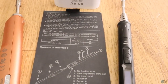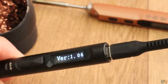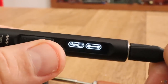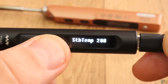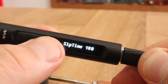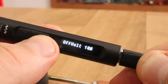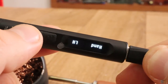Let's power it on. Plug the supply adapter that will give us around 9V, then plug the USB and it will automatically start — there is no on and off button. The USB cable is made out of heat-resistant silicone and it is very light. If I press the left button it will start heating, and the right button is for settings. In settings you can set the temperature limit, sleep time, and output power. Interestingly, the power can go over 18W — up to 24W. We also have voltage limits, fixed temperature, and you can select the used hand so the OLED screen will invert itself for left-handed users. That's a nice touch.